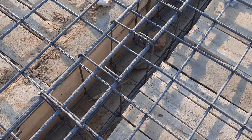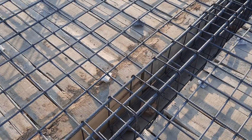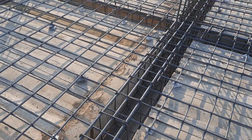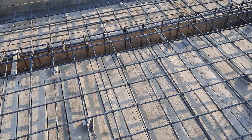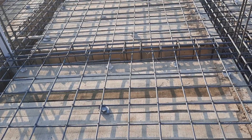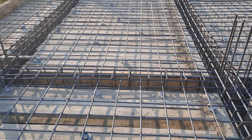You can see here this is the floor beam, which is 12 by 18 inches with slab and 12 by 12 inches without slab, with six numbers of steel rods — three at the bottom and three at the top, 16mm diameter. On the other side, they made some big mistakes, especially in lapping length. I will guide you practically on what they did in this steel structure design.